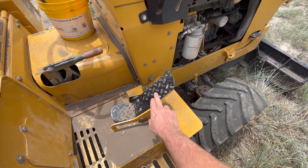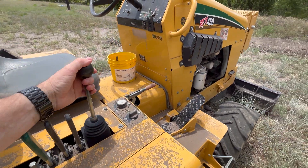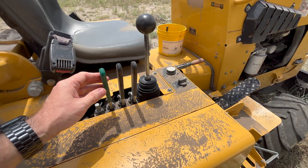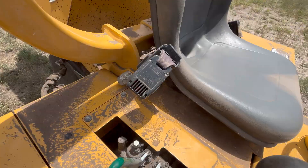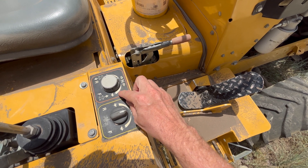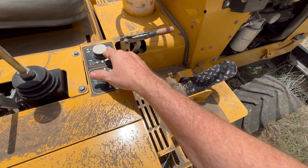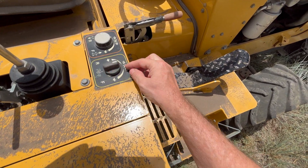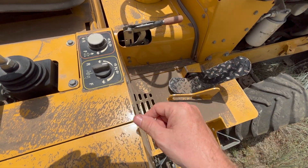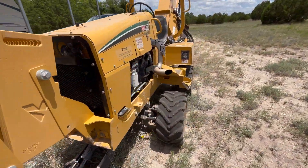You have the forward/back lever — push on your toe to go forward, push on your heel to reverse, much like a lawn tractor. It has a control knob for the front shovel and you can also tilt that, though I was told I don't need to know what that's for. The green one lifts and lowers the big wheel. There's a speed control for the machine itself — kind of like cruise control — but on this particular model that was disabled, so you had to drive it with your foot. The other control manages the speed of the saw itself. Notice the front counterweights — it's very back-heavy so it needs to be balanced.